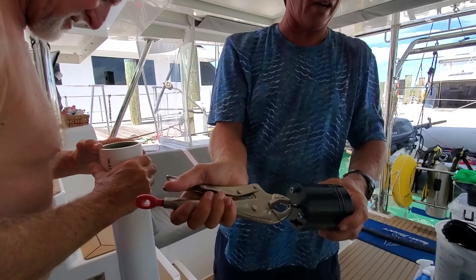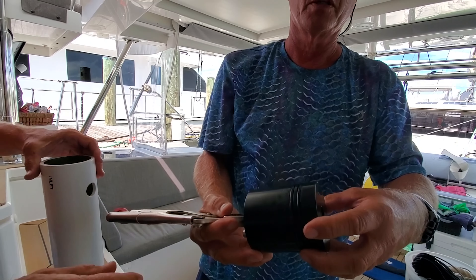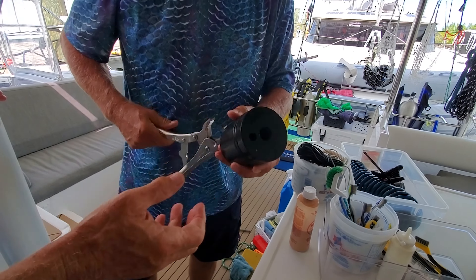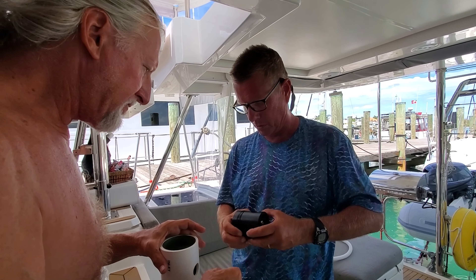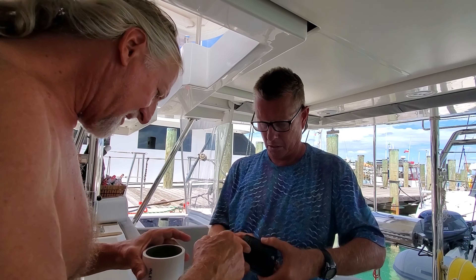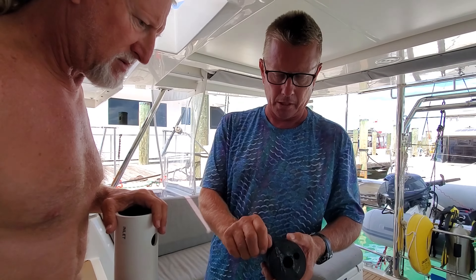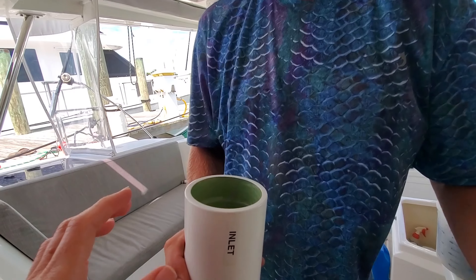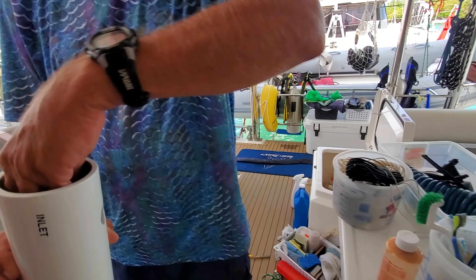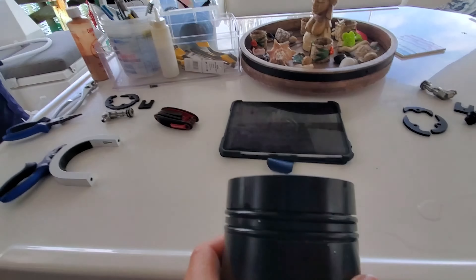Eureka! I have some really good lubricant — when you put this back in, these need to be lubed. These are the o-rings, so we take them out and inspect them. We might be having a problem because these o-rings are leaking and letting salt water back in. I don't see any damage, but you can gently remove them, clean them off, and re-lube them with Marlube. If they were leaking, it wouldn't have formed a good vacuum. Check the o-rings on both sides.